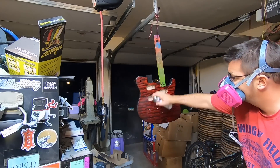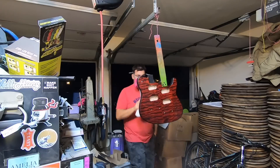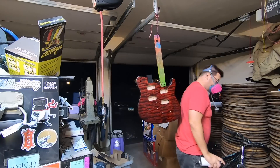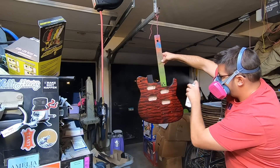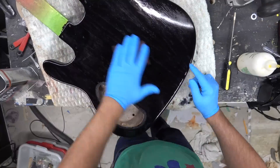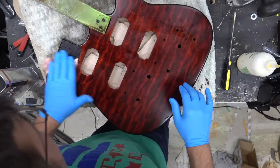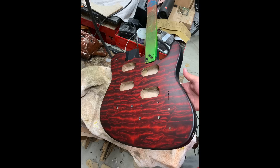This is the third coat of sanding sealer — I put five light coats on, which locks in the color. I do it very sparingly on the first three coats, and then by that fourth or fifth coat it's kind of dry and it looks good. Then we're using wipe-on poly — I'm doing four to five coats of wipe-on poly. And then we'll get ready for the assembly next. Thanks for watching guys, we'll see you in the next video.